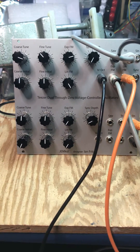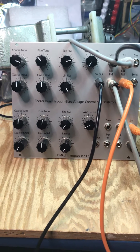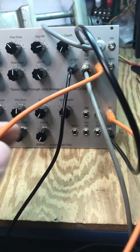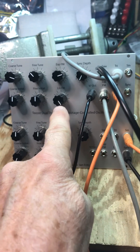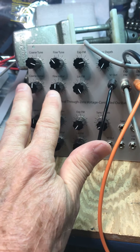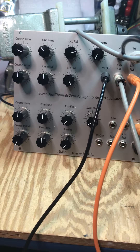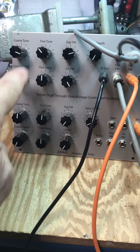I'm finally playing with this dual VCO that I put together a week or two ago. I've got basically the sine wave output of the lower VCO connected to the linear input, and I've got that maxed out on the upper VCO. I've got it set up so that it's right at the threshold of reversing, and the net result is it's low frequency when you set this up, even if you've got this cranked all the way up.